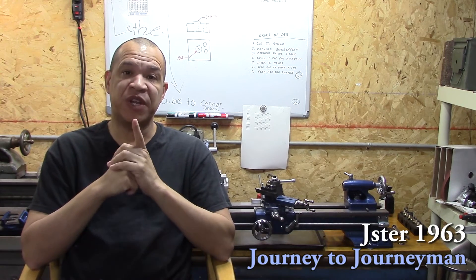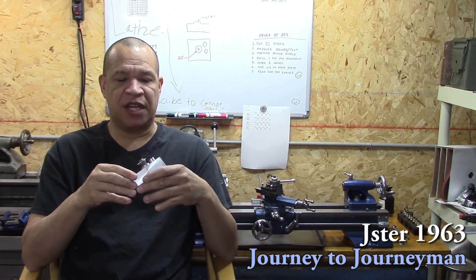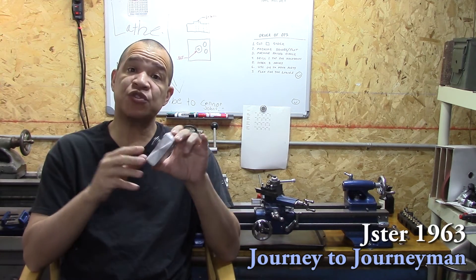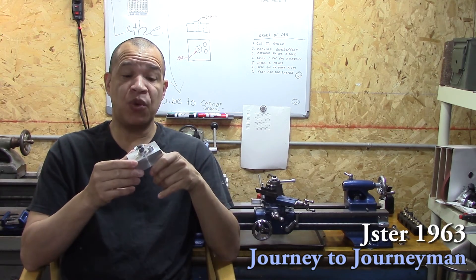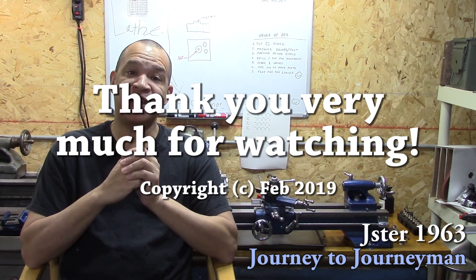A couple of lessons learned. The first one is: when someone sends you a viewer appreciation gift, be kind enough to open it up and thank them for it. Once again, Brian, thank you for that gift — sorry it took me so long to open it. As far as the fixture goes, I learned a little something about indexing. When you are indexing something, you have to be extremely precise. When you are doing it by hand tools, you have to take the extra time to really zone in and get things indexed correctly, or it will cause problems down the road. Fortunately for me, all I needed was two holes — once I got one drilled, all I needed was to index one hole around it. This worked out extremely well and helped me make those things a lot quicker. Thank you for watching, I hope you enjoyed this, and hope to see you on the next Journey to Journeyman.